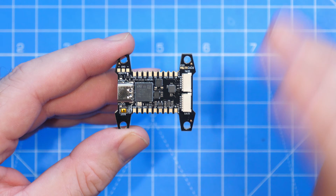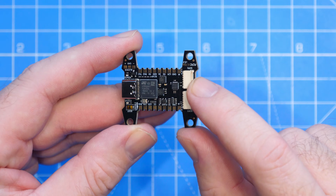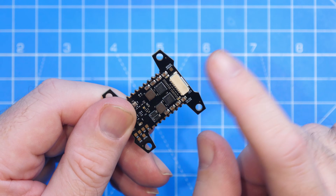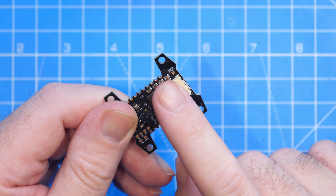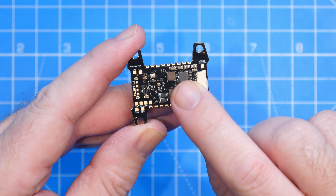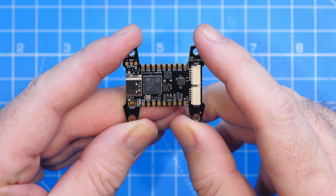Alongside all of that, you have your extra motor pads for motors five to eight, two external serial ports on connectors, and an eight-pin ESC connector which is based on the KISS wiring, not the FetTech wiring. Whilst you should be able to pin it straight to KISS without problems, I highly recommend you always check your pinout just in case. It also has those dual BECs on board, a dedicated current sensor pad, overcurrent protection on all data lines, and ESD protection on the new USB-C port.